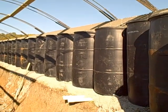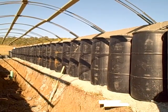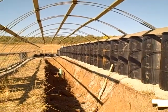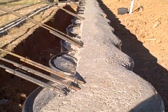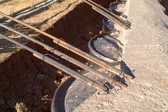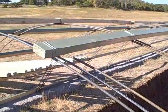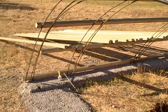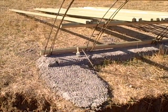What we're building here is a seedling house, greenhouse. All those barrels are thermal mass. There's rebar coming from the barrels over to a poured foundation. Here's a close-up of the connection between the barrels and the concrete on top of the barrels, and the rebar connections that go over the top of the two-by-fours that are wired on and down to a poured foundation where there's rebar where it reconnects to the ground.